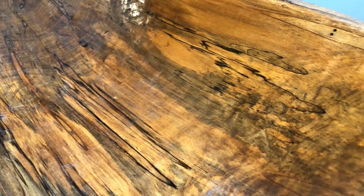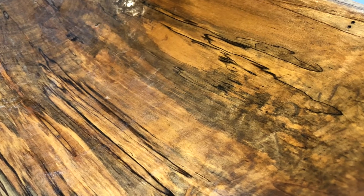Today I'm going to show you the techniques I use to carve bowls from crappy wood. Now normally I use fresh cut green wood, which is softer and less prone to cracking. But what you don't get with green wood, and you do get with crappy wood, is this amazing figuring that can happen called spalting. And that's when the wood starts to rot from the inside out. And you get this amazing color and streaks through it.